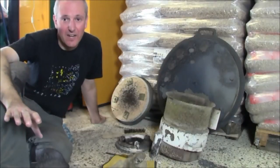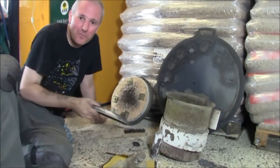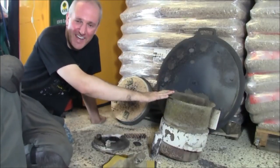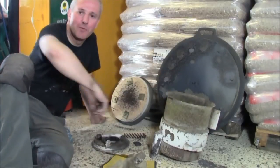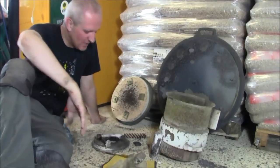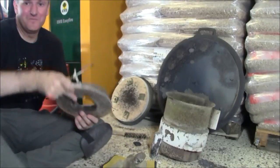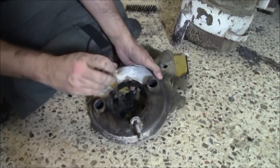Having cleaned out the actual boiler itself, we have some paraphernalia to clean. Firstly, that burn plate — you need to remove the clinker from that with a little brush and hoover. Then we have what I call the afterburner can, the top of the boiler, and the boiler cap — all of which don't have clinker; they just need to be brushed and vacuumed. It's a relatively quick job apart from getting the clinker off the burn plate. To get clinker off, just use an old screwdriver and whack it — as you can see, the clinker just flies off.